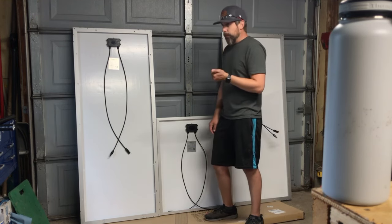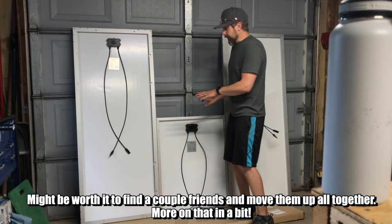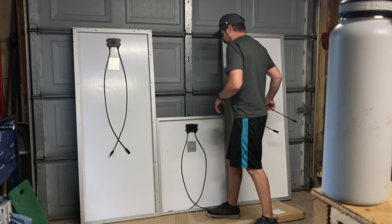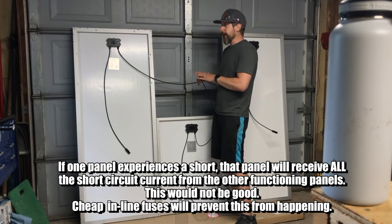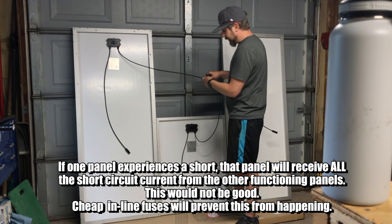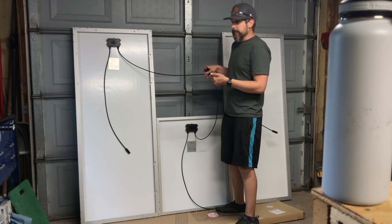If you want to maximize the output in partial shade, and if you have to mix panels, if you know what you're doing and you do it right, you can do it with parallel wiring. The other reason why I wanted to mock this up in the garage — I'm not going to keep these all together. This would be a handful to get up all bolted together. I just wanted to make sure that my holes lined up and I kind of wanted to see how these wires would be routed roughly. With parallel connections, you need to run inline fuses at the panels before you get to your branch connector. So each one of these lines is going to have a fuse, and then it's going to go to a three-to-one connector.